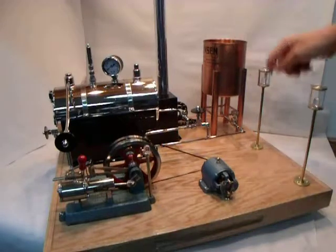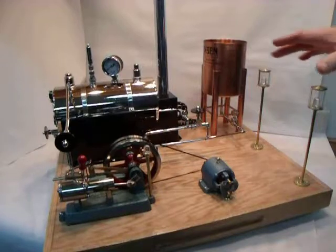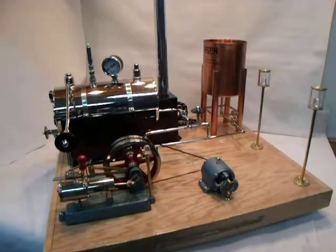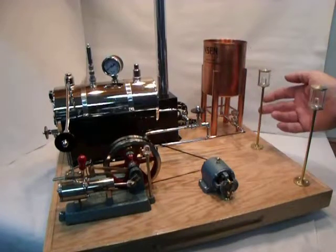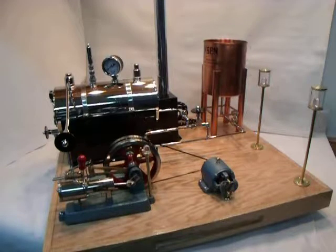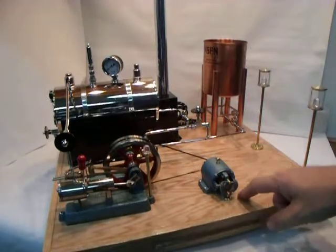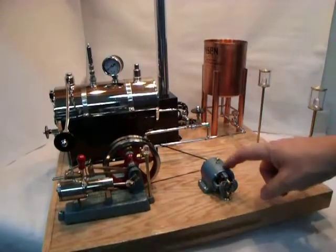It's got half-inch pipes and quarter-inch cross members, all soldered together. These are lamp stands and the idea was borrowed from forum member Kevin. I contacted him and he graciously allowed me a copy of the set for myself. So if you want a set, contact Kevin and he'll be happy to make you some. These are 316s with all brass top and bottom, and they have a 10mm LED bright white bulb in them. The lines run down inside the pipe to a terminal here under this PM Research center.